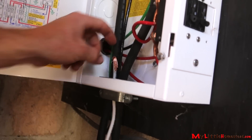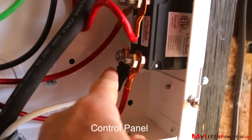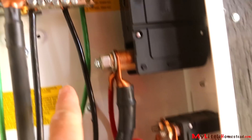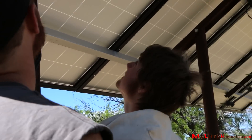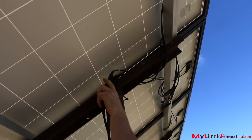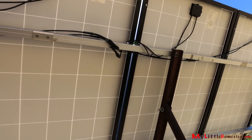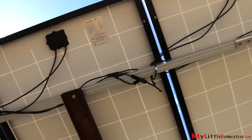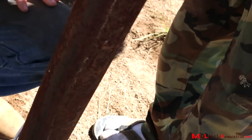Electricians, look away, please. The white wire went up to this and the black one goes up there. This charge controller can take up to six panels. We have six panels separated into groups of three and three. The reason is we get too many amps running through the little wire, so we can't have six panels running through the thinner wire. We wire two sets of three panels into one box and run them into a big six gauge wire underground, which goes straight into the control panel.